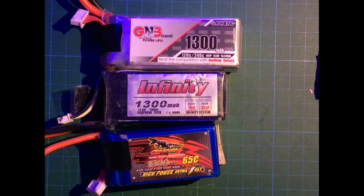As we've seen, the different LiPos have different power — 65C, 70C, and 120C. The extra power needs to come from somewhere, so the battery is a little bigger and heavier, meaning slightly shorter flight time. It's up to you what you're using the LiPo for. A hardcore racer would go for a lighter LiPo with less weight, while a freestyler doesn't need such a light drone and can use the bigger one.